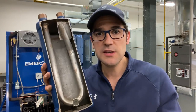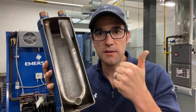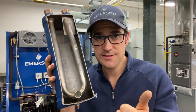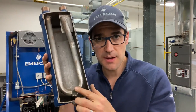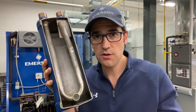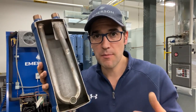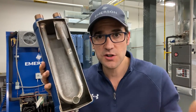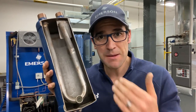The thing you need to know is if you don't install it properly the first time, if you don't use inert gas, this screen could plug up. You won't get that oil back to the compressor and you'll get a seized compressor, or a bad system failure — compressor failure. It could be a bad electrical failure, which a lot of people call burnout, or a bad mechanical failure where there's a lot of dirt in the system that makes its way back and plugs this little screen.